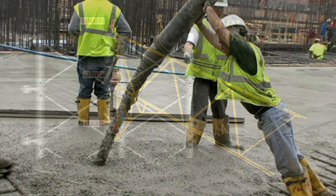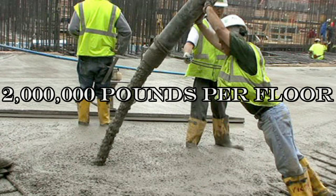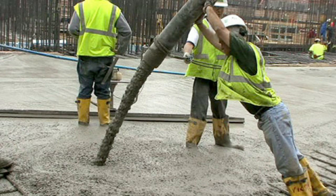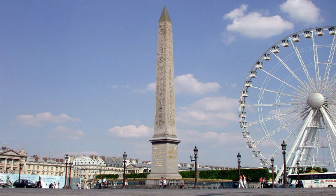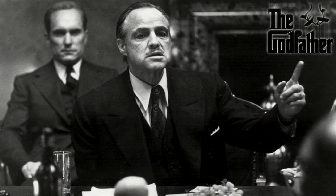The flooring can be conventional with four inches of concrete, but if possible, I'd rather do without. Four inches of concrete is 50 pounds per square foot; for a floor plan of World Trade Center proportions — 200 by 200 feet — that's 2 million pounds per floor of dead weight, or over 900 metric tons. Concrete is needed for only four conceivable purposes: weight holds the building down in the wind as in an obelisk; soundproofing, being massive, it won't transmit much sound to the floor below; as passive fireproofing, concrete is a substantial heat sink; and lastly, the mafia made you an offer you couldn't refuse.